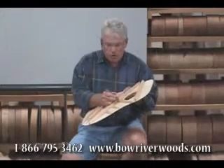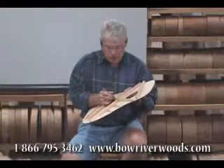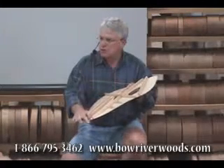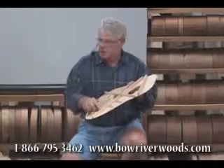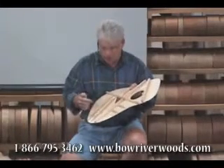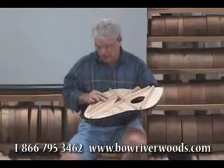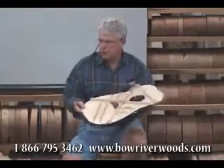The way we did it was we would start to taper about like this, and we would simply taper these down to zero — going from a thicker brace, graduating gently all the way down to nothing. And likewise up here, we would take the peak and take that all the way down to zero. Does that make sense? Do you have any questions about that?